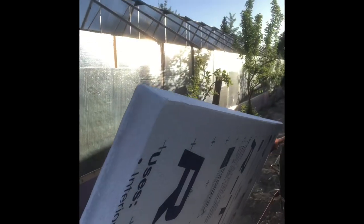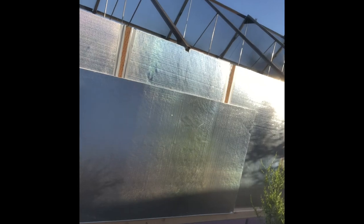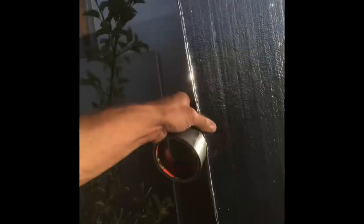We are insulating the second layer of foam on this greenhouse on the north side. So we'll show you what that means. Everything else is up and down. So we're coming across and we basically will have our 2x4 that will go across the bottom and then two rungs on top. If I could push that over really good. Butt this up as quick as we can or as good as we can. And we're giving it a thing of duct tape to hold it in place, as well as just get as much R as we can, a much shear factor, whatever.